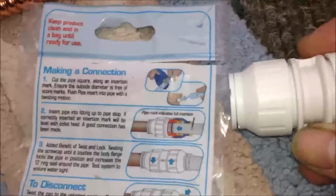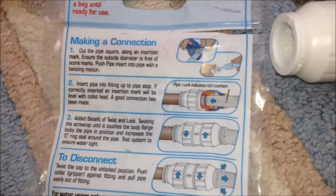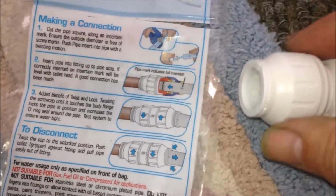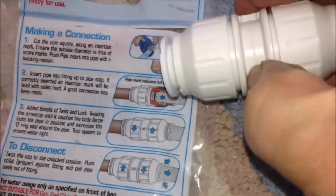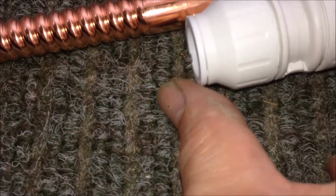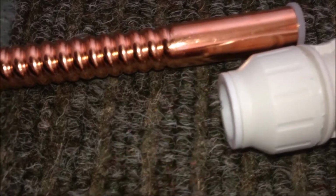So this is the connector, and the instruction here is just to say, cut the pipe. If it's a plastic, you use that kind of cutter and use an insert. And for the copper pipe, you can just use the copper pipe only. And you can see here, there's the stop over there. So you cut it until the stop. I think around here in the middle, there's the stop for both sides of the pipe. So the insert position is around there for that bendable pipe.